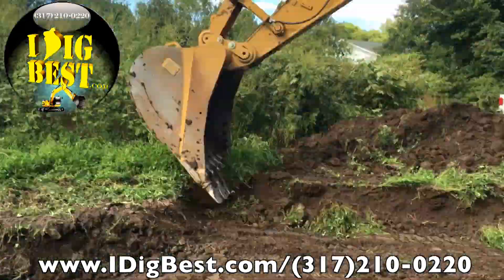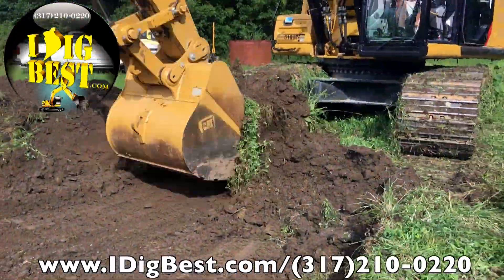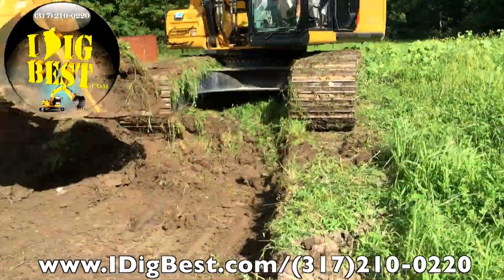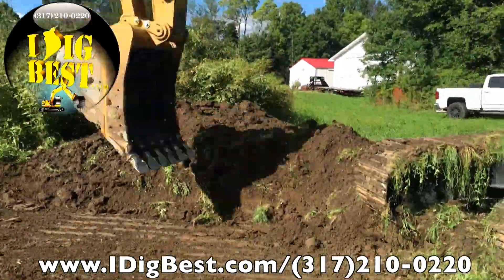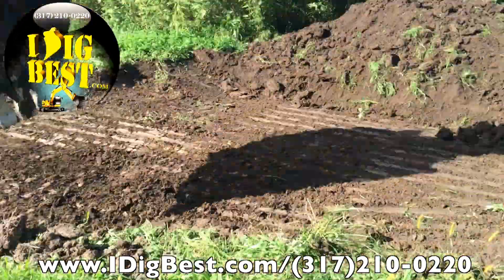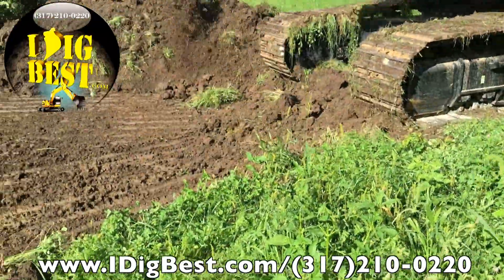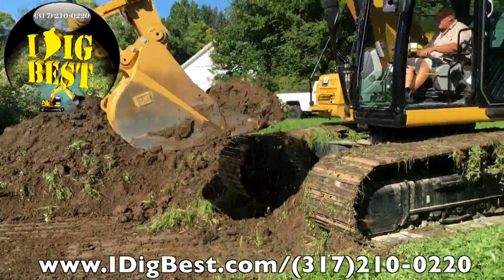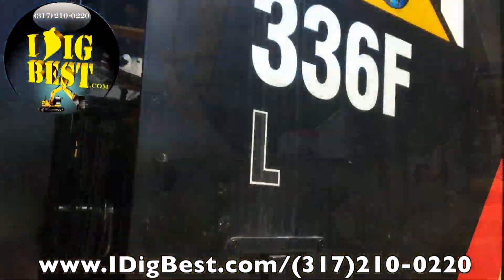Just to get a feel for how it digs — it's just a plane we're digging on. We have it set to level and it can be completely under the machine. You'll see the Cat system: when it gets the pass straight up and down on the dipper stick, it fails pretty bad. So this is a very nice way to cut grade very easily.